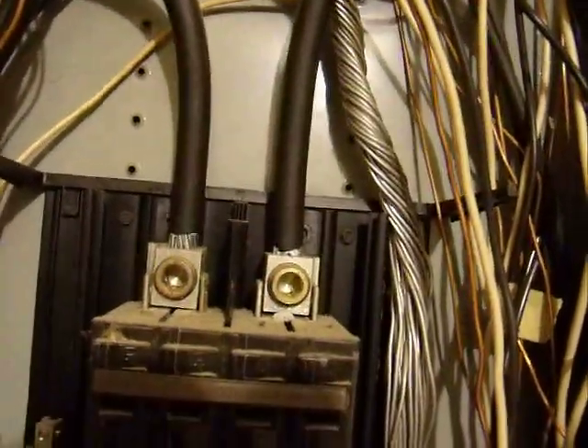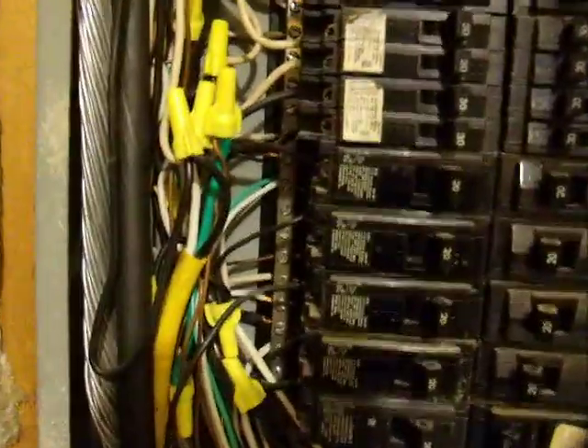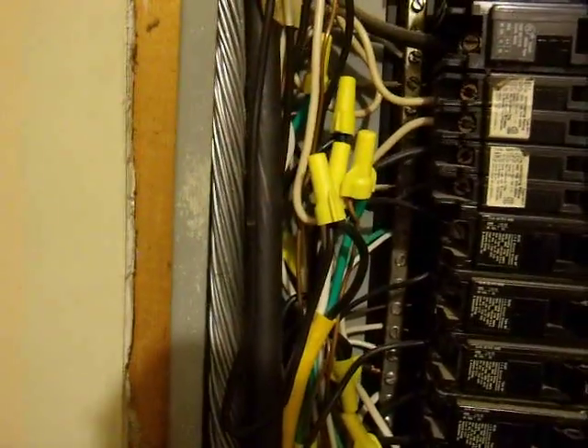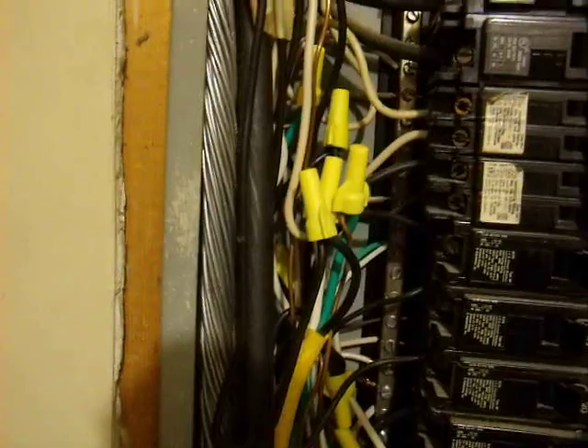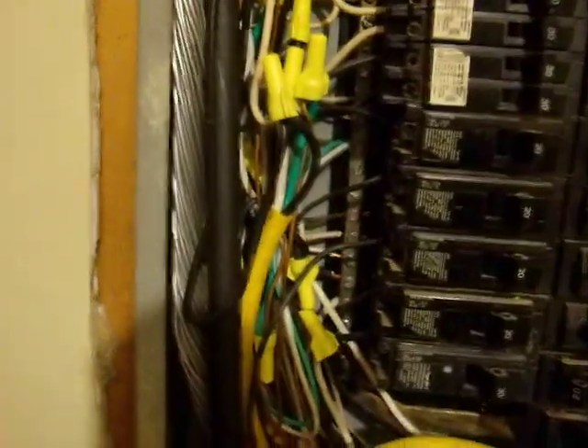What you end up with, you've got two of these 110-volt legs and then a major ground on both sides. So you just take those three wires loose — all three of them, all the grounds and the hot wire — and add to them. I use the 12-3 ground wire because I ain't making no long run. They're just going right here at 12, plenty big for all this. In fact, I haven't had any trouble whatsoever.